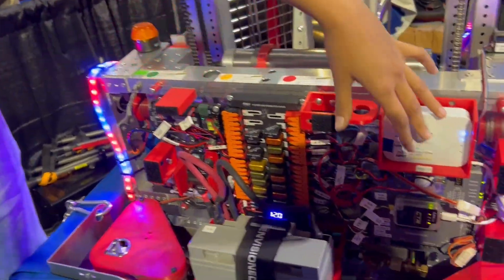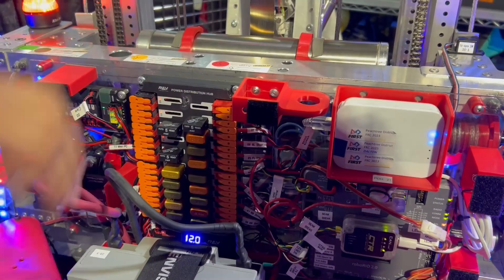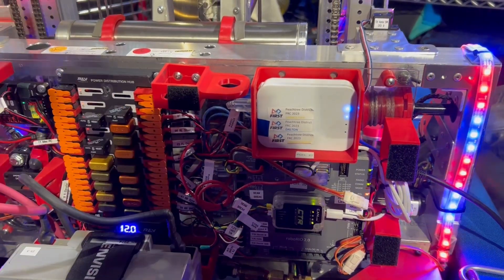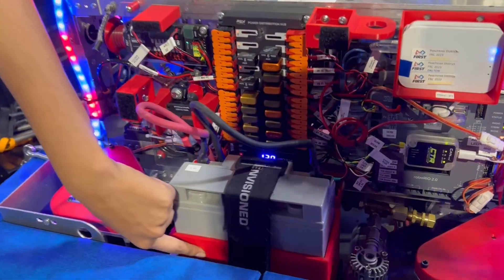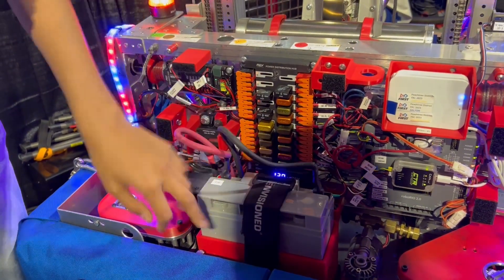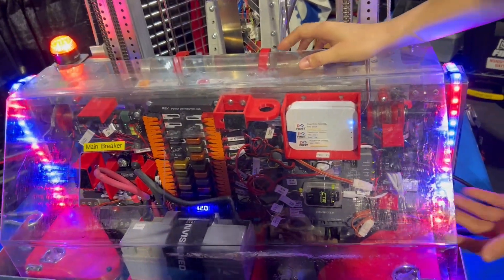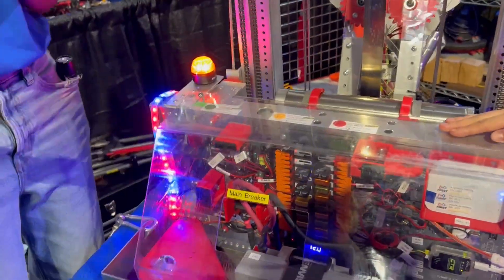Our electronics board has a removable cover. We can always access the main breaker and everything is labeled, making it easy to get to anything we need to fix. Once we take the battery out, you can see all the breakers — everything is labeled so it's very easy to determine the source of any problem and address it almost immediately. Our battery box is made out of TPU — the first version was PLA and we snapped it off the bottom, so the second version is TPU, which acts as a shock absorber. The strap goes around the belly plate and the back of the chassis so the battery is firmly secured. We also made a shield after the Dalton competition — we got hit a couple times and it damaged some things. It's got four points where it locks in, so if any robot climbs up, they just deflect rather than damage anything.